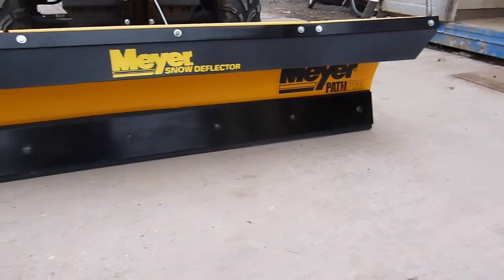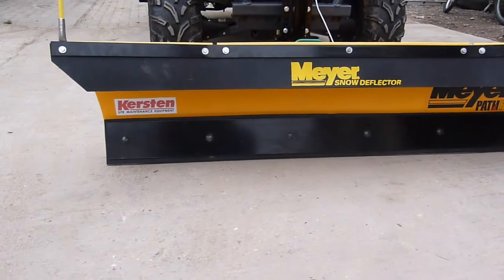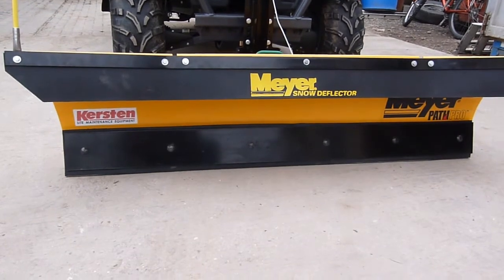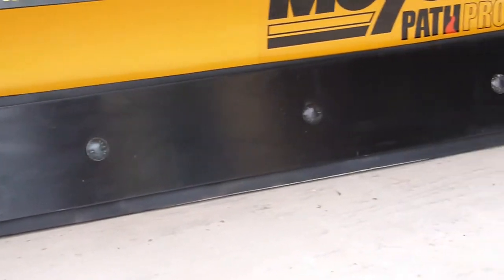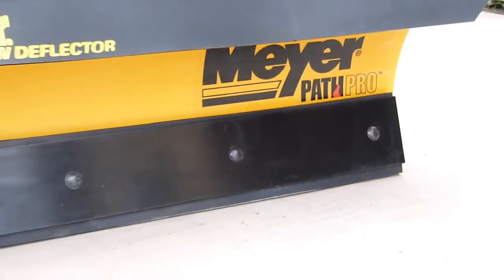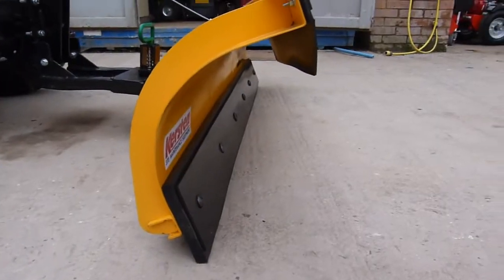This plough has been fitted with the optional urethane cutting edge. This six inch by one inch adjustable edge is manufactured from polyurethane. Why do we use polyurethane rather than rubber? The answer is because rubber is biodegradable — it tends to rot and degrade over time with exposure to the elements. The relative benefits of high abrasion, cut and tear, oil and ozone resistance in urethane makes it a clear choice for professionals, with substantially less downtime and cost per metre of snow cleared. The urethane cutting edge outlasts other materials by a margin of five to one when severe abrasion is a factor.